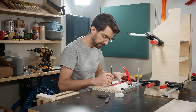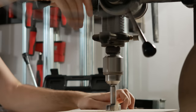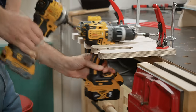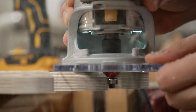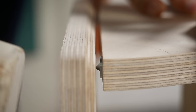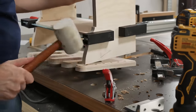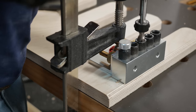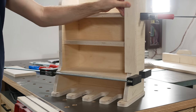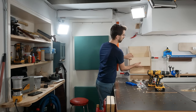I didn't make a template for the bottom drill hanger shelf, so I just laid out and marked everything I had to cut. I first used a Forstner bit to create the inside curve, then cut the rest out with the bandsaw. I sanded everything smooth, then put a decent chamfer on the top side where the drills will hang. One thing I regret is doweling the bottom shelf from the bottom to the sides - it makes alignment pretty tricky. However, the Dowel Max being as accurate as it is made this possible and the joint came together nearly perfectly, but if I were doing it again I would just screw the bottom up through into the sides.